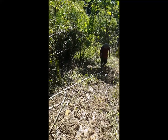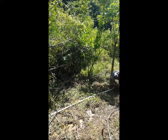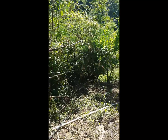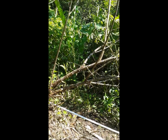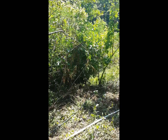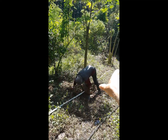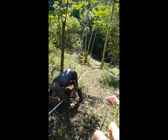with 8 meters of fall in it. And we're using about 5 gallons a minute coming from a spring up here, which is actually quite a ways up the mountain. We have it lower down here to be able to also bring in, when they need it, water from the river in the dry season. Then here it falls, as I say, 5 gallons per minute, about 20 liters per minute, falling 8 meters.